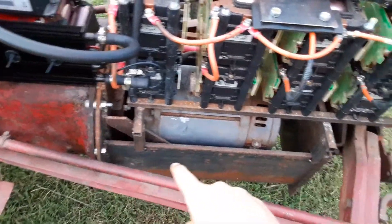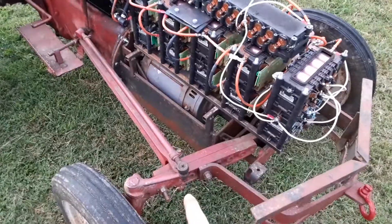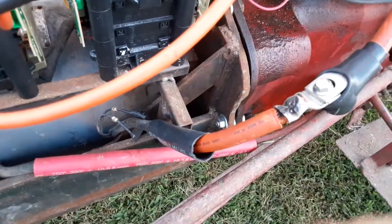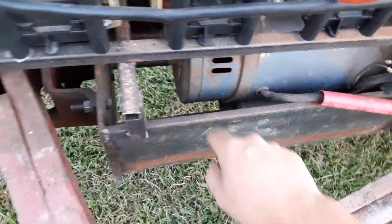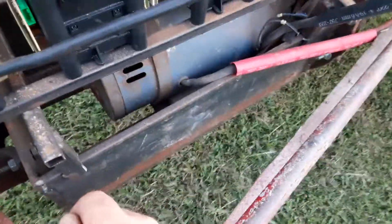The motor is actually a stressed part of the chassis. Without a motor, all that hangs out are the steering arms and a solid axle that pivots up at the top — so having this solid was really critical. This is all scrapyard steel. I made the adapter plate out of what was actually a gooseneck hitch ball plate I bought from a friend for ten dollars and cut down with a cutting torch. It's eight inches tall, four-inch wide angle, half-inch wall. The smaller stuff is three-quarter 16-gauge scrap. So it's more or less built from scrap.